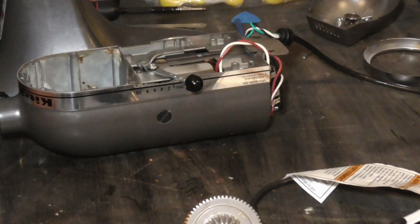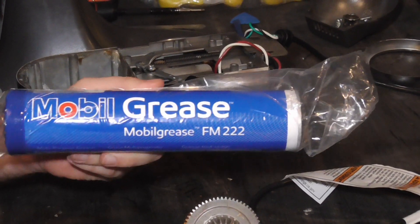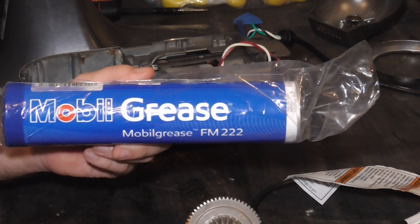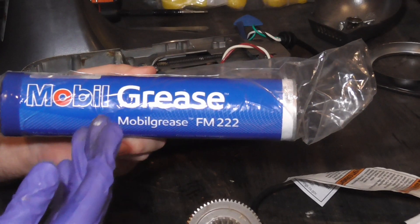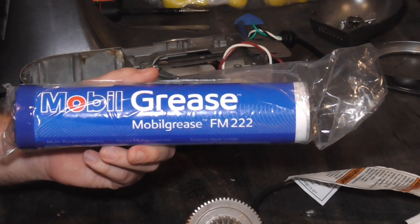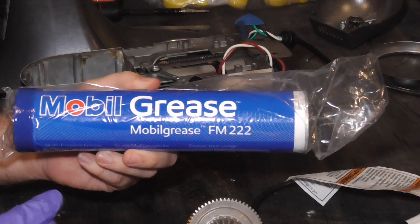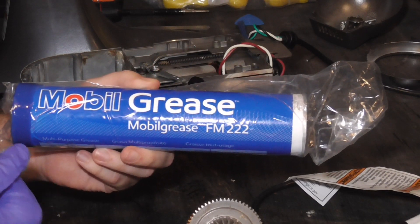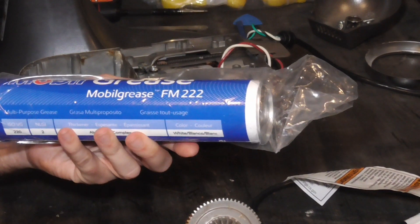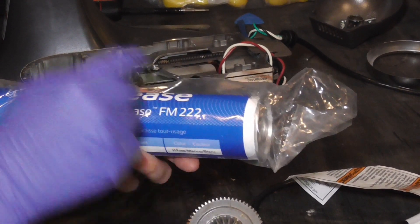There are all kinds of rebuild kits you can get online that come with their own grease, but I've seen some pretty bad reviews on them, so I went a little overkill. This is Mobil grease — the grease they use in industrial food machines, which means it's food safe, which is what you need for any incidental food contact. If any grease leaks out and accidentally touches food, it's not going to be a hazard. It's really not that expensive — I'll put a link in the description. This is 14 ounces, but you only need about four or five ounces for this gearbox — maybe about that much of this grease will go in there.